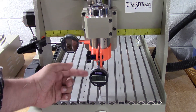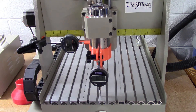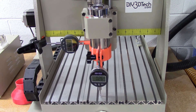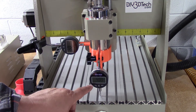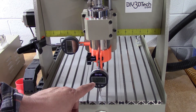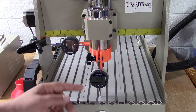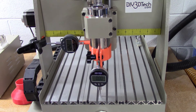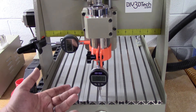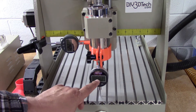And this is one of the reasons I did this downward stanchion that the gauge mounts to — to clear the bit and the spindle head, which you really can't see because it's behind the mount. So watch as I run this down — I'm going to issue a G zero command. So I have issued a G0 Z negative five command. You can kind of see it's really, really close to five. So I went down five millimeters. Now what I'm going to do is come up five millimeters. I issued basically back to my home position, Z equals zero. And you notice that I'm just a tiny bit off, so this is actually tuned in pretty close.